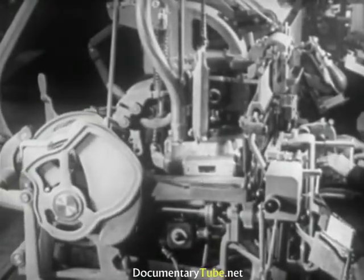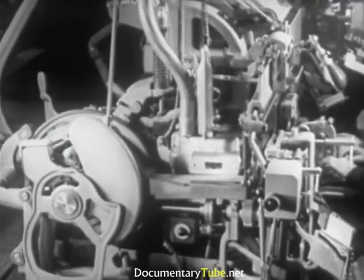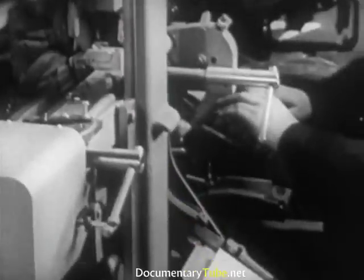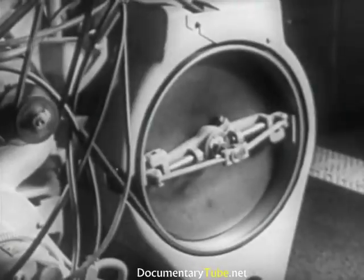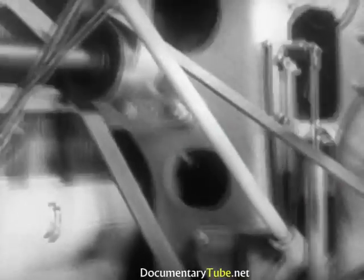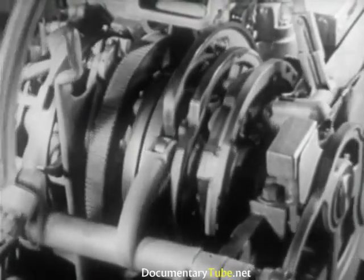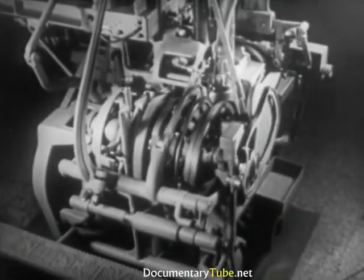The casting unit starts operating automatically as each matrix line is delivered. It takes from five to ten seconds for a complete cycle, depending upon the speed of assembly. All the while, the operator continues to compose. A one-half-horsepower motor supplies the drive transmitted by a large pulley through a transmission gear and belt. Many of the basic mechanical actions of the machine depend on the ten large eccentric cams situated at the rear. With a series of springs, they make up a completely automatic setup.